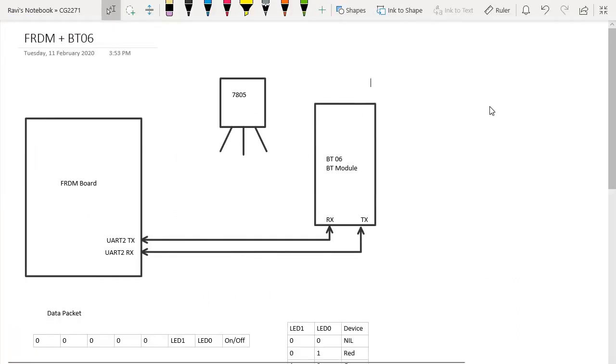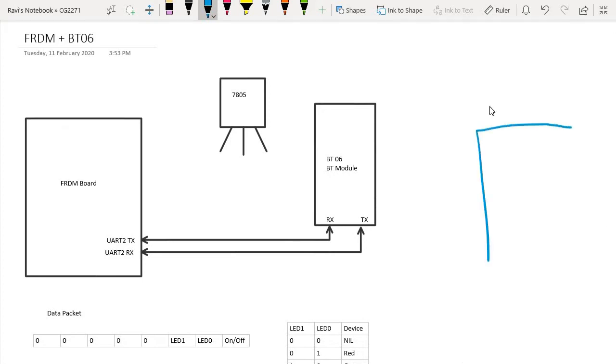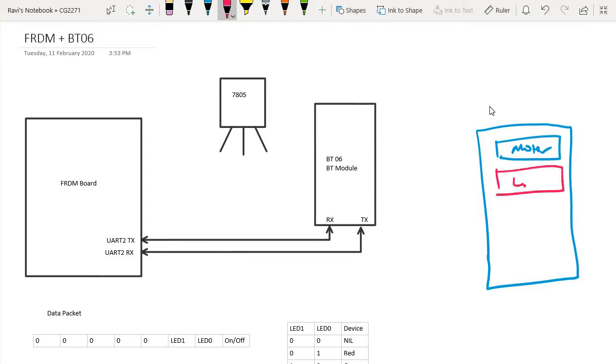In this video, I'm going to explain the whole flow of how your mobile phone app works. Your project requires you to create an app on your mobile phone that will have some buttons — for example, one for motor control, one for LEDs, one for music. We want the commands sent from your mobile phone over to the Bluetooth module to be relayed to the microcontroller on the Freedom board. This is how the whole remote control feature is going to be implemented.